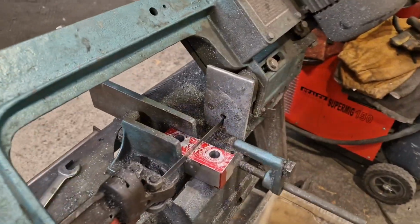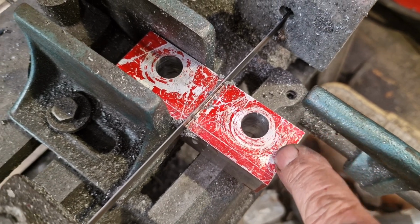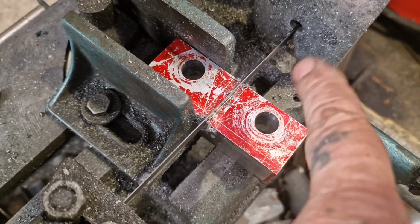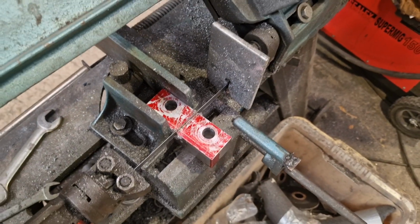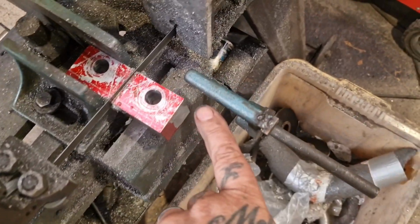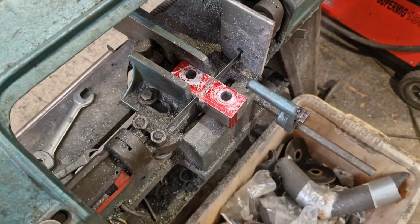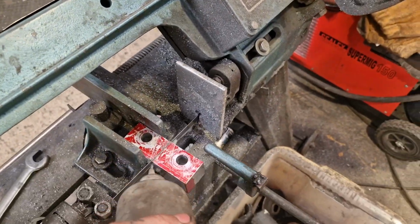All right, we've gone with a split. The reason is that I'm going to mill them to this line, both sides, and I can't do the middle with the joint together. So I'll do them separately. I didn't want to slot them first because one of the edges will be unsupported and it might flap about and crack or do something, you know what I mean? You might get upset, as we say.